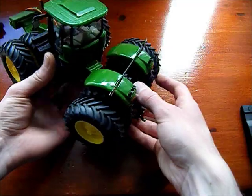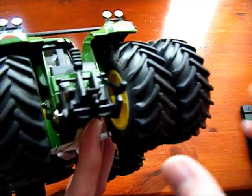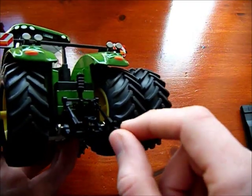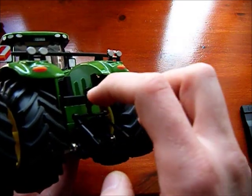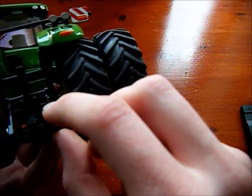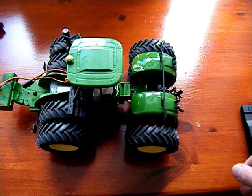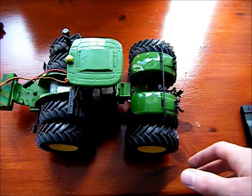For those interested in a functional hitch: I was able to screw an M3 screw in either side of the hitch here to keep it in the upright position so it's freely moving. Once you've done that, if you mount your servo inside your tractor you should be able to run a cable to attach up here to pull it up and down, and that should give you a hitching motion. Anyway, that's all I have for this video - if you have any questions post them in the forum, give us a thumbs up if you liked it, and I'll try to do more of these videos. Thanks for watching.